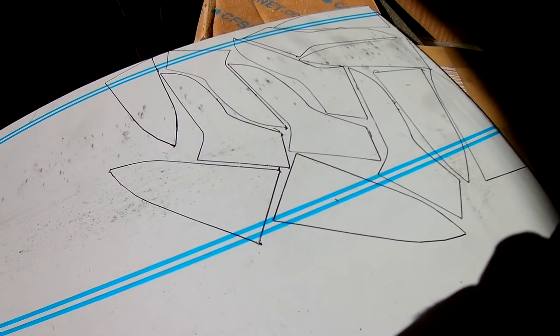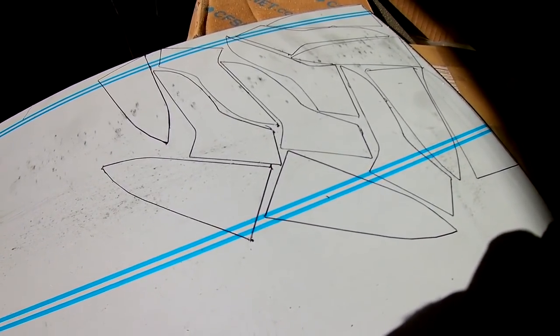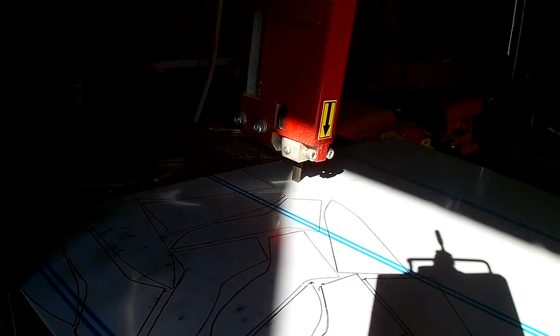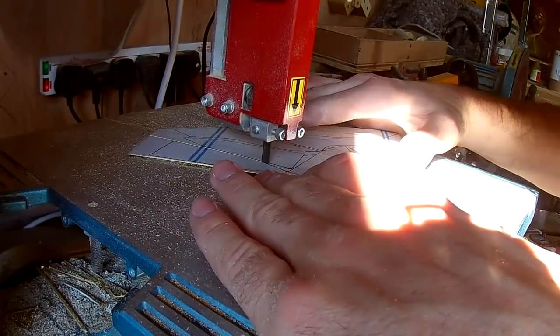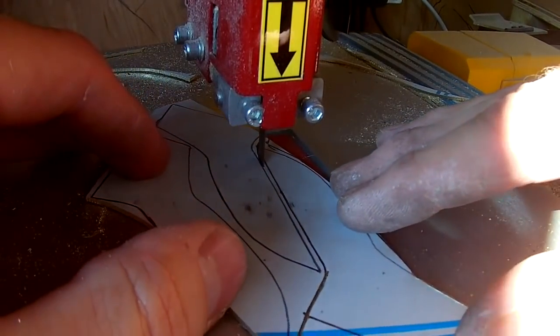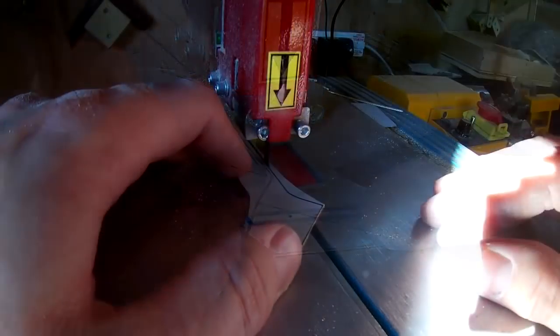What I've done is to break the character down into its constituent parts and then draw around some templates onto the brass sheet. The original version was made out of very thin brass sheets which I was able to cut with scissors. This time around I'm making it out of one millimetre thick brass sheet so it's a little bit more difficult to cut, so I'm going to be using a bandsaw. Quite a lot of individual pieces — it's comprised of all these different blades so it took a while to cut all these out.